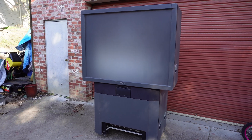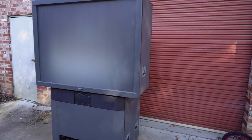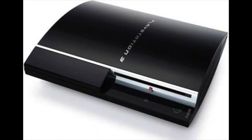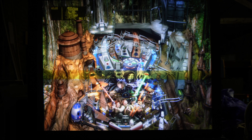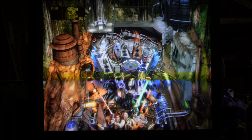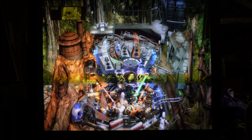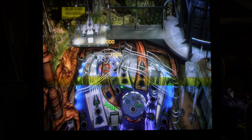It's time to test the card on our old friend, the Sony RVP-6010QM — a big 60-inch rear projection CRT multi-scan projector. The card is inserted directly into one of the IFB slots, with the PlayStation 3 hooked up via HDMI. This is a Star Wars pinball table from one of the Zen pinball game collections. The picture is looking quite good, considering the rear projection unit isn't even calibrated. Currently the setting is at 720p. When I go up to 1080p, the convergence goes out a lot on the projector, but I don't believe that has anything to do with the card — that's more the settings and capabilities of the projector itself.